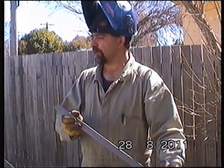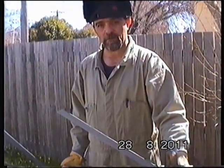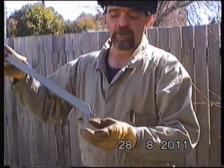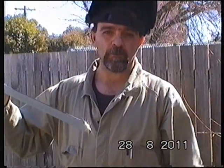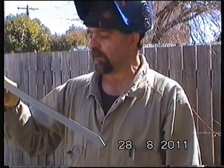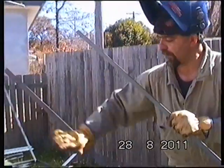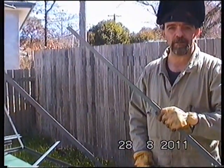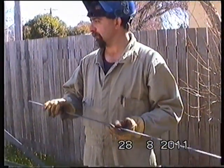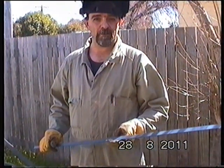All right guys, what I've done here is determine these pieces - the angles. One angle goes at the bottom as you can see, and I also determined the top angles. I cut one piece as a template, then cut the rest of them - a total of eight altogether - so I can create this shape and have a flat surface here at 52 degrees, as a pyramid is. I'm going to tack them together now and keep building this beautiful pyramid for Thomas Travagal's project.